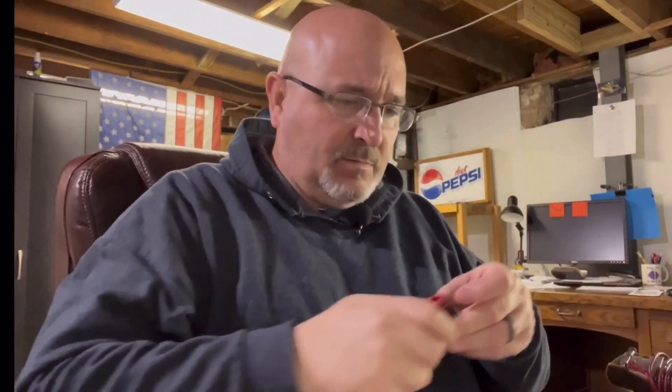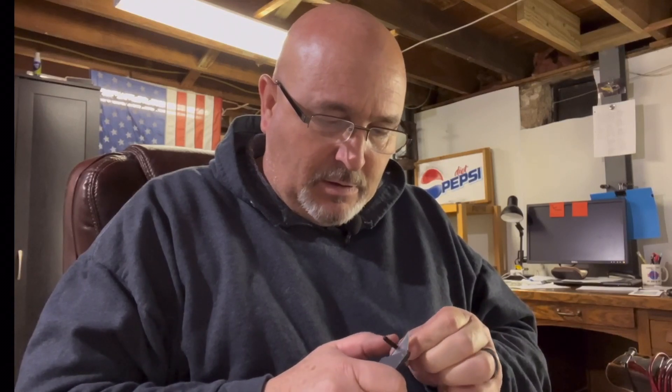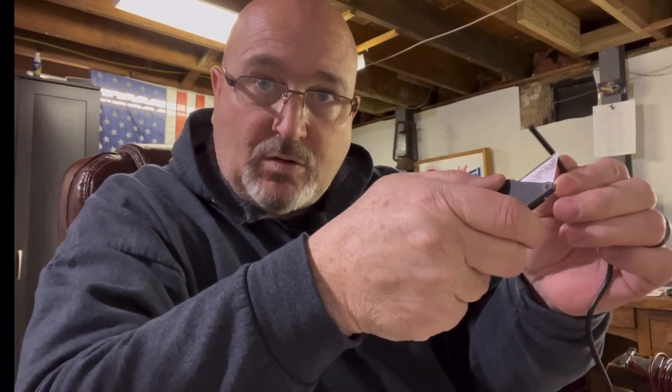We're going to try and test it out first - I've already cut it up and I want to make sure this is going to work. This is where the multimeter and the crimper tool come in. To strip the wire, you want to very carefully cut the outer piece of rubber. If you're using a razor knife you've got to be very careful because it will slice you open. What I do is just roll it across the blade with my thumb over it ever so lightly.